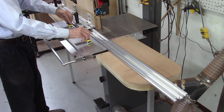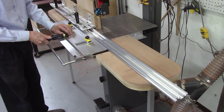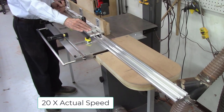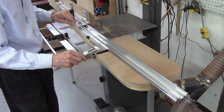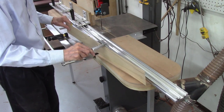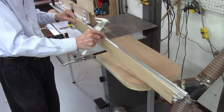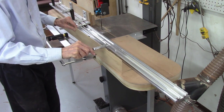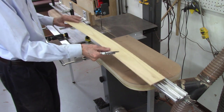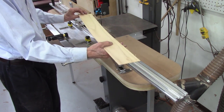Make sure these are still tight. Loosen my mag jigs. One turn for the kerf of the blade, and let's do another full turn to give me a 50-thousandths-inch-thick piece of wood. So here's that board fresh off the bandsaw — this was a super severely warped board. Let's see what we have: I got 50 thousandths, 50 thousandths, 51 thousandths, 50 and a half thousandths. Going to the bottom: 52 thousandths, 51 thousandths. So again, perfectly straight, parallel, edge to edge, top to bottom — and that was from a severely warped board.